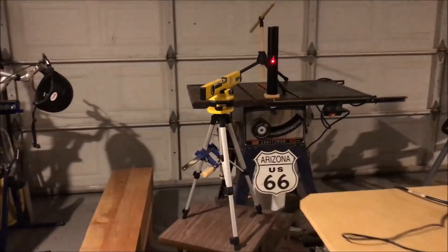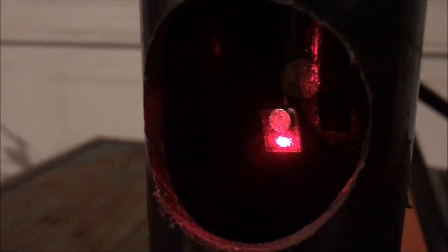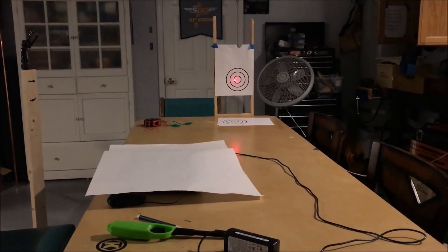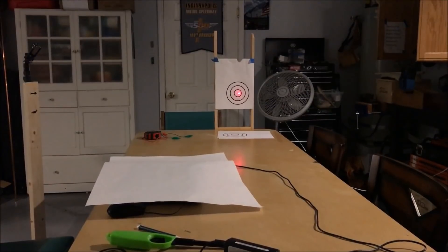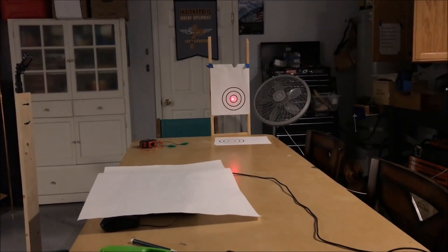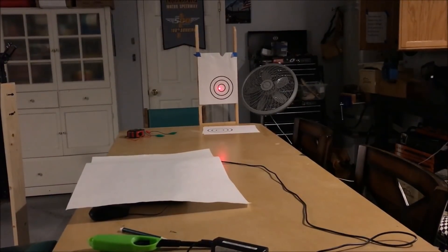You have a laser shining on a mirror that is suspended inside this pipe. The pipe protects it from wind and breezes and helps it settle down. It's a first surface mirror wedged onto a thread by two small magnets. So we have magnets attached to a mirror suspended on a thread, and that beam is then projected back to a target. We get the law of reflection off the mirror, which gives us greater sensitivity, and we can run that beam out as far as necessary. This makes for a pretty sensitive low-frequency electromagnetic wave detector. We'll start off at 15 feet and work our way out.